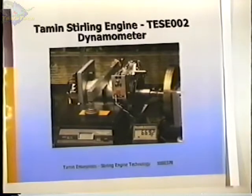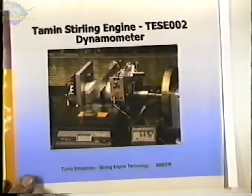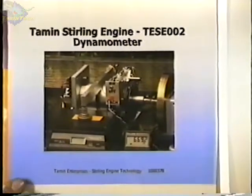This is a dynamometer that I built for that engine. It's basically a cradled generator with an arm on it, and the force is being read by a digital scale. From the moment arm and the force, you can calculate the torque. The tachometer here is an optical sensor reading a perforated disc to get the speed. I'm still working out the details on this dynamometer so that I can use it for measuring power.